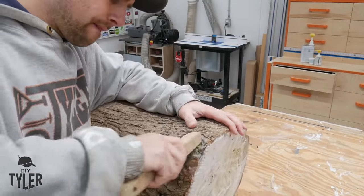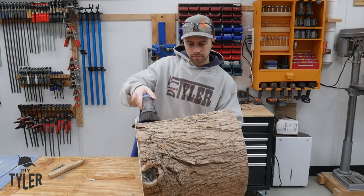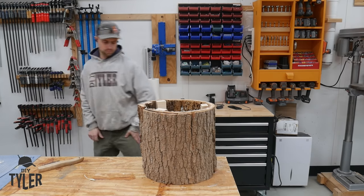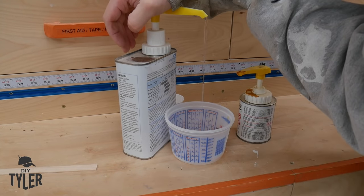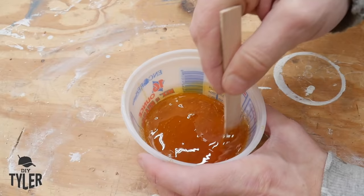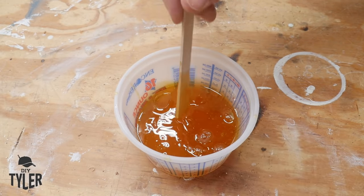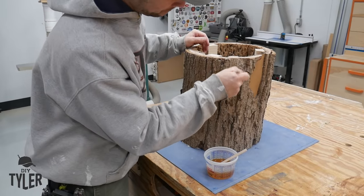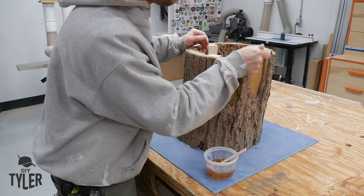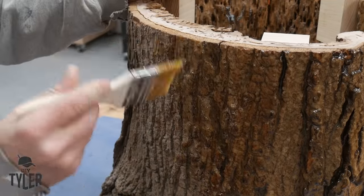Using a wire brush first to make sure any loose pieces of bark get broken off — I don't want debris in my epoxy when I paint it onto this stuff. Then a quick rub with the shop vac brush to make sure all the dust is out. Then it's time to mix up a little epoxy — a little goes a long way. I'm using some old West System stuff, and the hardener looks amber, which it probably isn't supposed to, but a little amber tint on the bark wouldn't be noticeable. I used a cheap chip brush to paint it on, keeping an eye out for bristles pulled into the material.